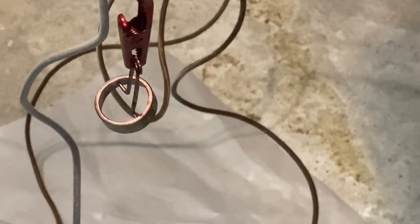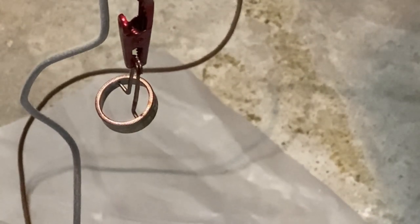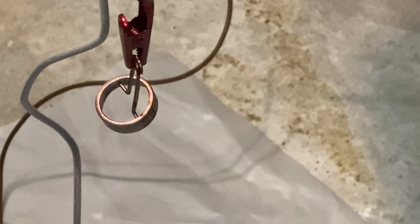Okay, so the last step to finish this ring is that we're going to put on a clear coat, and that's going to serve two purposes. One, it's going to help this patina really pop, and second, these clad coins are well known for turning some people's fingers green, so this clear coat's going to seal it and prevent that from happening. So I'm using a powder coating system from Harbor Freight. It's modified. And instead of using the gun with an air compressor, I've got this modified shaving brush that we're gonna use to apply the clear coat.